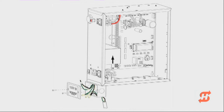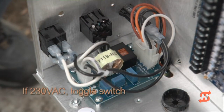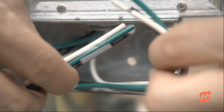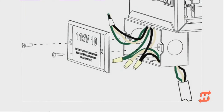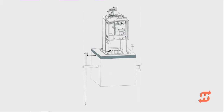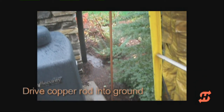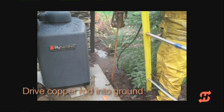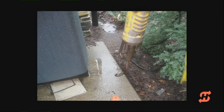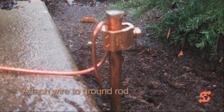SwingSmart DC is factory set to 115 volts AC. If your source power is 208-230 volts, you must switch the voltage selector on the power board. A junction box provides the input power and convenience outlet wires. Use wire nuts to make the electrical connections. Always follow local electrical codes when running AC power. To set the earth ground, drive a solid copper 5/8 inch diameter, 10-foot long rod into the ground beside the operator. The ground rod must be wired to the chassis using a single length of unspliced 6-gauge copper wire that is less than 3 feet long. Check with your local jurisdictions for additional requirements. All grounding must be completed in accordance with the National Electrical Code and NFPA regulations.